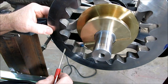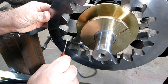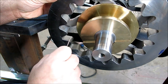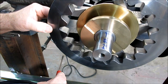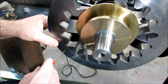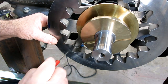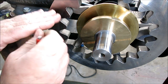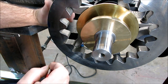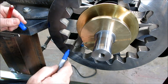Let's see if we can find a spot here — one of the ones I was looking at. So this would be kind of normal here, where the pattern is touching in a couple places. And there was one spot I was looking at — yeah, there's a good one right there. You see that shiny spot? There's a little high spot right there, and it's kind of displaced metal. So to me, that means that's touching down pretty hard right there in whatever the mesh was between those.